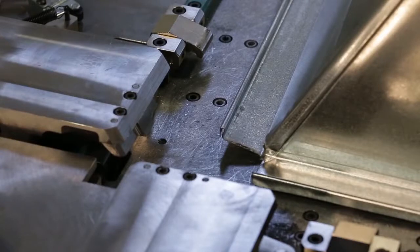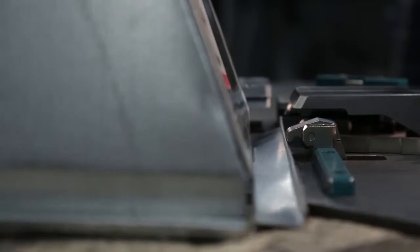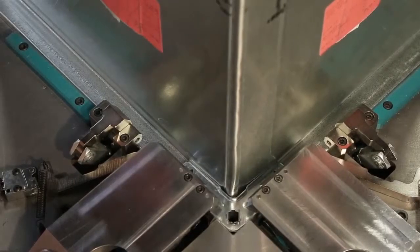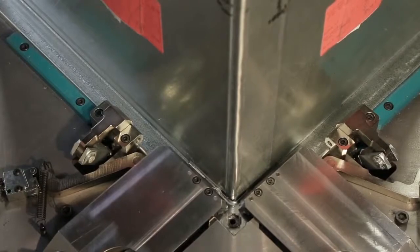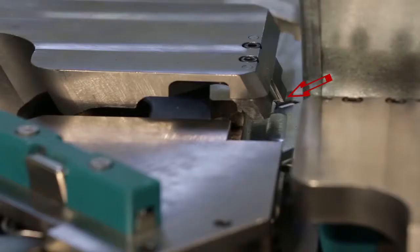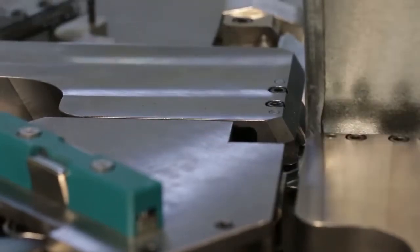1. The new clamps eliminate feed jams by pressing the flanges tight to the work surface and pull the hem against the guide bar. 2. New press heads come in with angular motion, allowing clearance on less than 90-degree fittings. Guide wedges force the corner tight to the duct wall. These combined features, along with a redesigned crimp block, ensure no jams and tight crimps every time, 26 through 16 gauge.